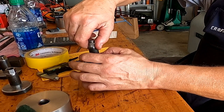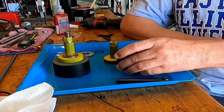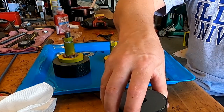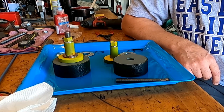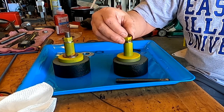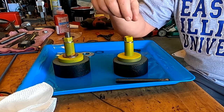The lathe's casting will sit right down over this, and from the topside you'll be able to turn it up and down to where you want it. Looking back at the feet, we coated them with Flex Seal and it made a really nice hard rubber coating — I can barely dig my finger into it. The bottom and sides are nice and hard, rubbery feeling, with a good tack — they're not going to slide. One foot I've already put on the lathe and it seems to be working out excellent. I also grooved the T-nuts to accept a snap ring on the top, which will keep the foot from sliding out of the base when I move the lathe.